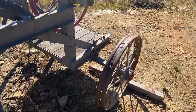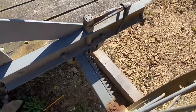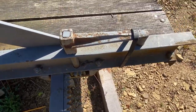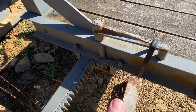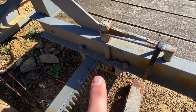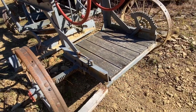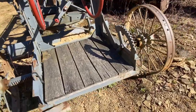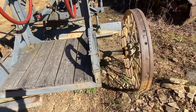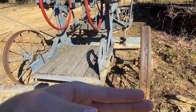Also on the back here, this rear axle has a rack and pinion on it, as you can see right here. What you would do is use this hand crank — you crank that and that spur gear drives this rack. You can actually offset your axle depending on how you were grading. You can also tilt the axle like this on the machine.